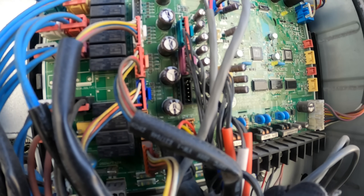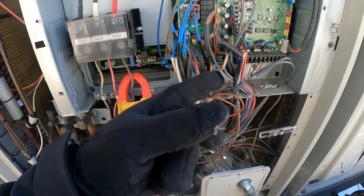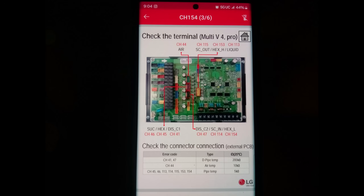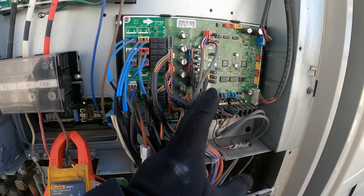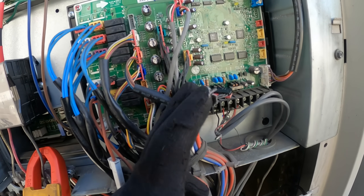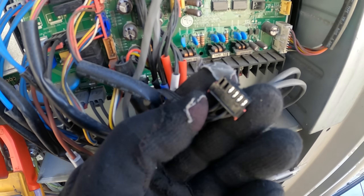In the app, they show three different types of resistance readings: a 5 kΩ thermistor, 10 kΩ thermistor, and a 200 kΩ thermistor. There's a pipe thermistor chart — I'm assuming that's for this one — then there's a D-pipe which I'm assuming is discharge, and the other one would be air. Let's check resistance readings and see what we've got.